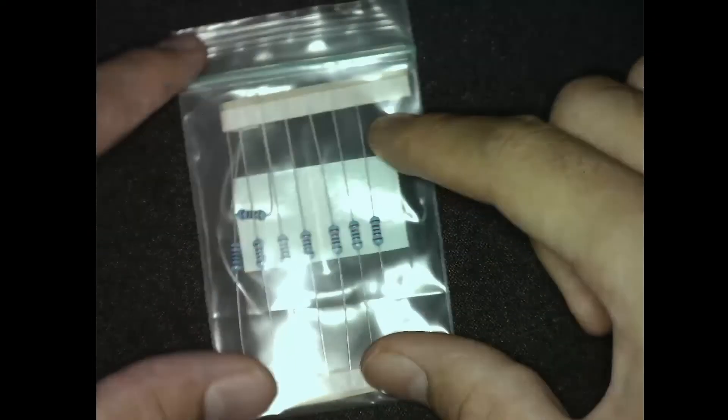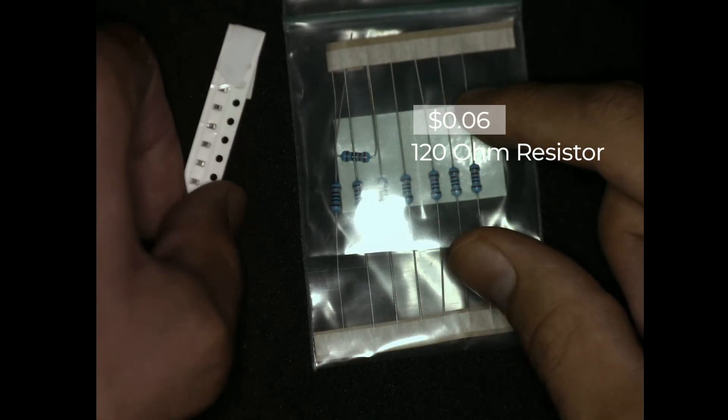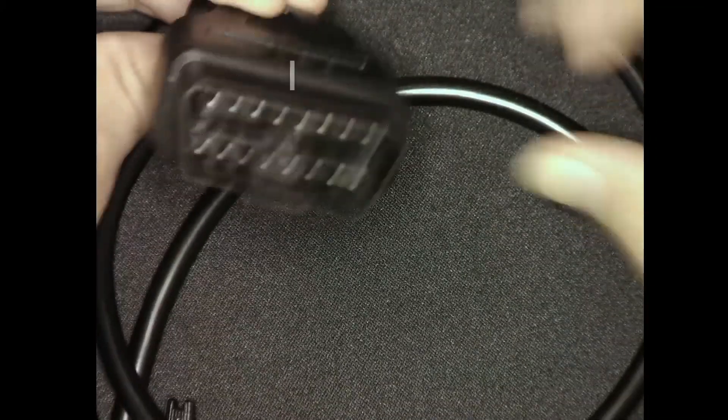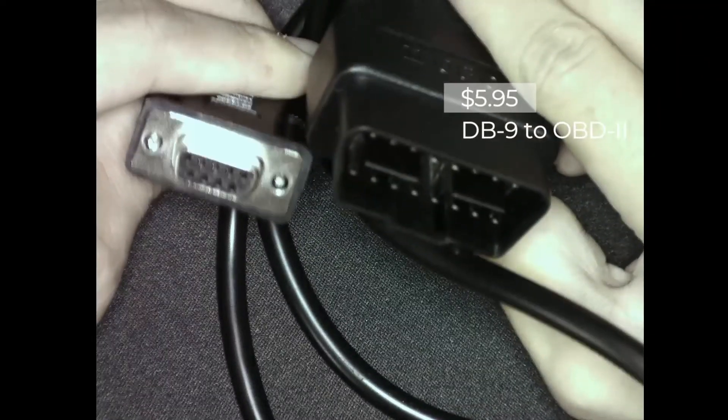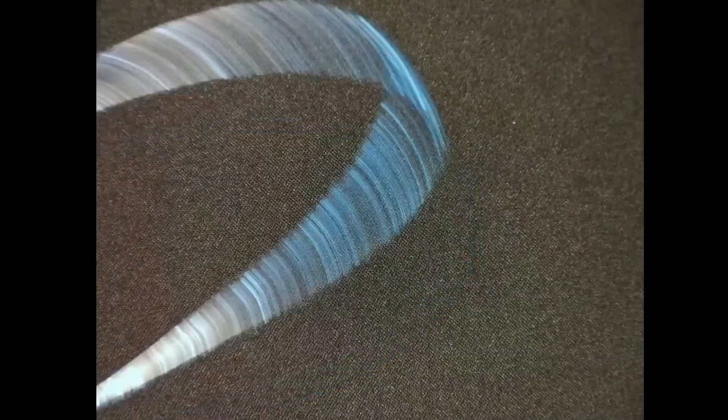Here's the box it came with — $6.99, you can't beat that price. After that, you're going to need some 120 ohm resistors. These are through-hole resistors — you could solder them onto the CAN High and CAN Low headers, or use a 0603 SMD resistor, but that thing is tiny. You'll also need a DB9 cable — make sure it's a straight-through cable, not a null modem cable. Finally, you need a DB9 to OBD2 adapter — get the one from Adafruit, not SparkFun. You need CAN pins 2 and 7 to be CAN High and CAN Low. I'll link it below. And of course, a USB cable to program the Arduino.